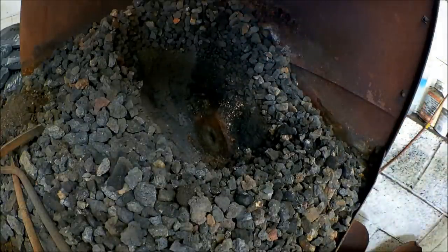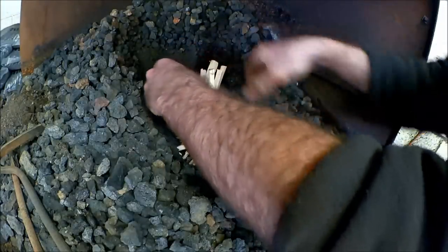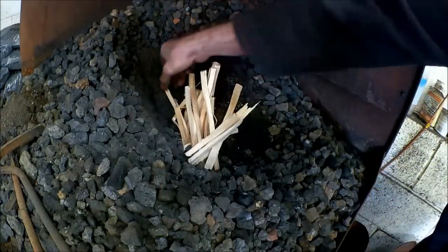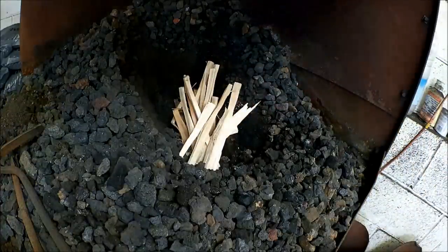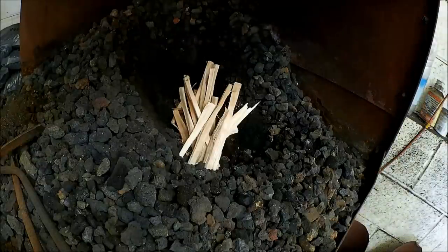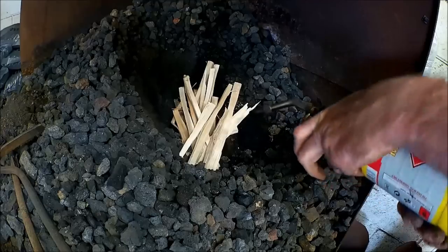So now, all I do is add my wood — just a nice big pile like this. You can roll up a newspaper if you like that. I can't be bothered, so I'd either use wood and light it with a burner, or if I'm really lazy I'd just light my oxy-propane torch and light the coals at the bottom and build it up from there without using wood at all.